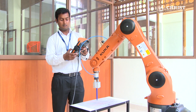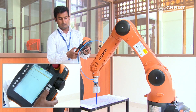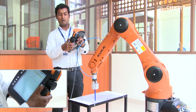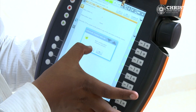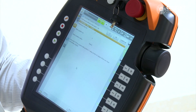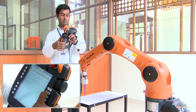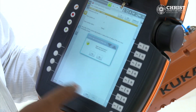We have to move the robot tool tip for marking the first reference point on the table. Set any reference point, then click on Calibrate. A small window will open — press S. Then move the tool tip to a different point in the X axis to define the X direction. Again click on Calibrate and press S.